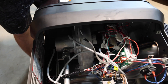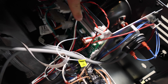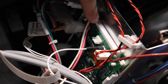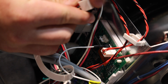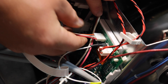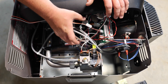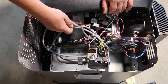You can see where we plug in the cable — it's this switch in the very top of the heater. This connector right here is where we're going to plug the low-voltage communication cable into. It says SEL switch on it; it also says pool spa vac. It just plugs in — you can see these pieces go downwards and it should just seat well. Keep in mind, if you have an older style version of this heater, they recently redesigned it to make that easy to get to. It used to be tucked away and the board is oriented differently, so it was just harder to get to.